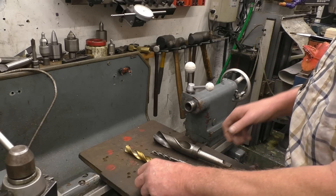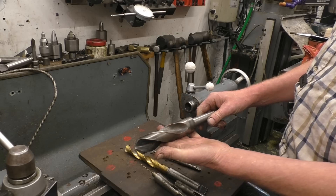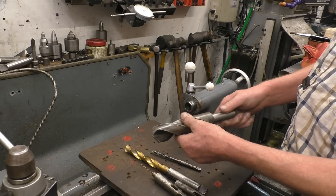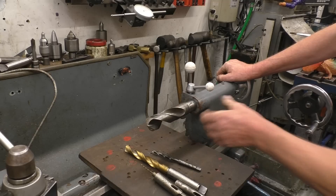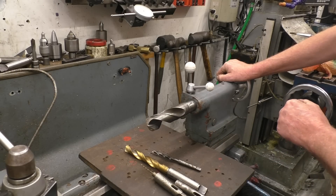You can also get a one Morse Taper drill — really small ones — that go into a 1-to-3 adapter, just the same. I've got a big drill here — that's the biggest drill I've got — that's inch and a half. That goes straight into there and is for really removing large amounts of metal very quickly.